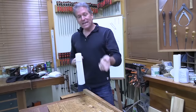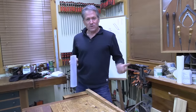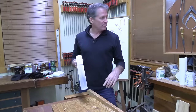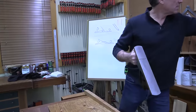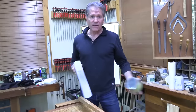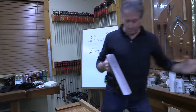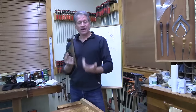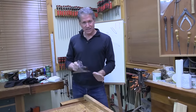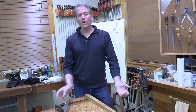One of the big keys to having a wonderful experience is to keep the sole waxed. I took some carnauba wax and wiped it on there before we started. You can use paraffin or a spray type wax. So: thin, even shaving - just wax the sole and you will have a wonderful time. If you're just beginning, do yourself a favor and start with pine. It's enjoyable, you'll get less resistance - it's like a creamy textured wood that is a real joy to plane.